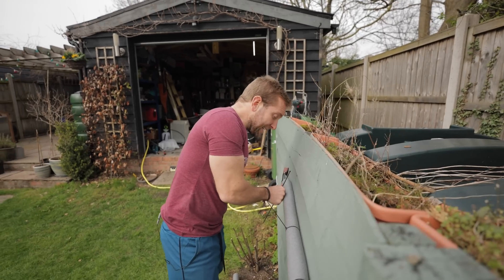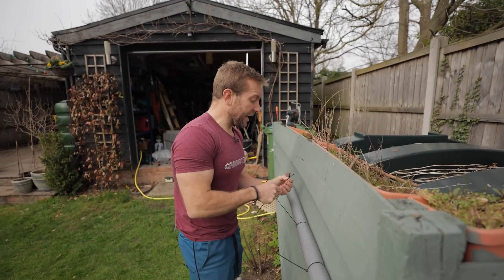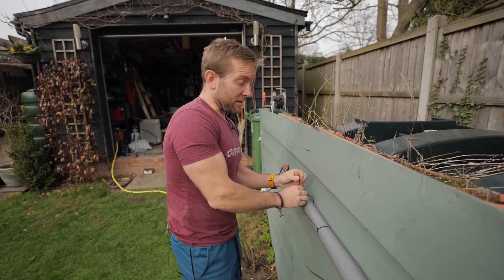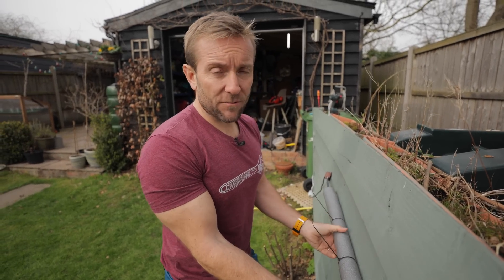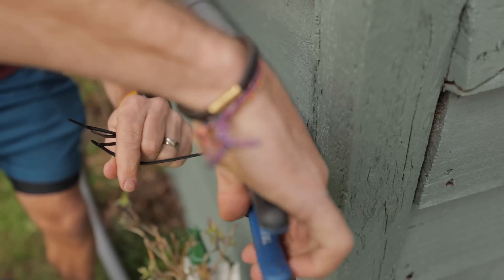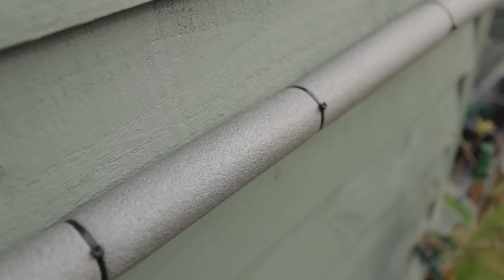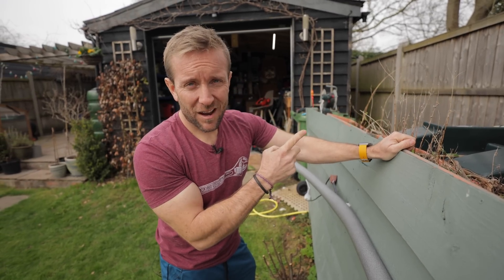The reason I say don't use standard foam insulation outside is not because it's bad insulation, but because it's not UV resistant. You'll need to get UV-resistant insulation — think Klimaflex or Armaflex, they make the UV-resistant stuff. It's more expensive but it has really good insulating properties. If you left standard insulation out in the sun, eventually it would degrade to the point where you could rub it off with your finger. So, lovely little job — never going to freeze again. If you need more help on basic plumbing, especially on how to fix pinhole leaks, click on the related video. Subscribe and join the locals community.